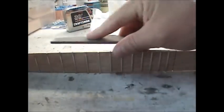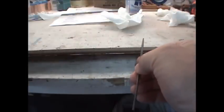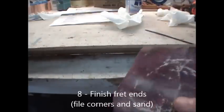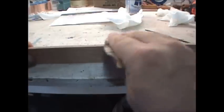The first thing I like to do is knock off the edges, because those are what's going to catch you up. Start working these down a little bit. I finished this side — it's nice and smooth. I filed the edges some more with this file, and then I took sandpaper and just went back and forth, a little bit curved over the edge with my fingertips.